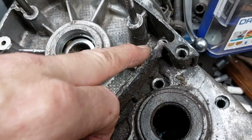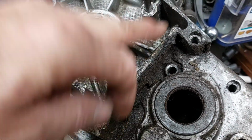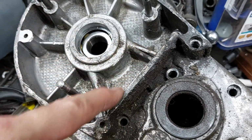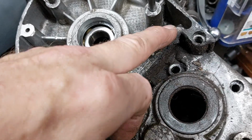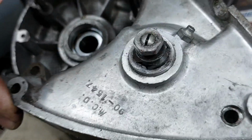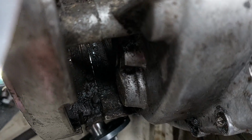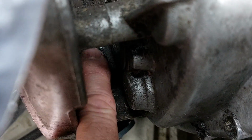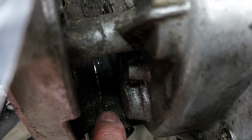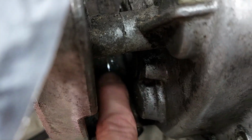And the other thing was this crankcase repair, where the chain's obviously broken at some time, whether it was due to the screw and the stuffer plate causing carnage and causing the bike to seize up and snap the chain. I don't know, but this has been repaired, but I think there might be a bit of a gap between that and the top cover that allows all the muck to get in there. You can see where the case is pushed together, and there's light coming through there. It's not quite flush fitting faces, so it needs a bit of attention there.